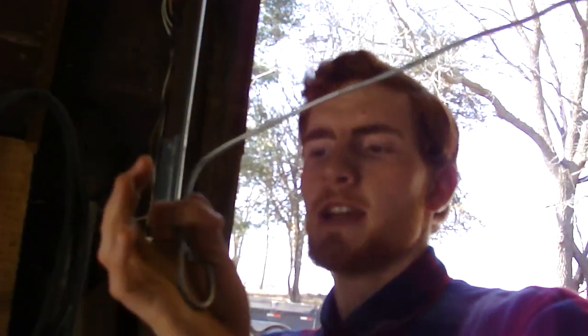This tool right here is what we call our slag dipper, and it's designed so that you can be a little ways back from the edge and dip out slag. And slag is just basically any surface area on the metal has a little tiny bit of dirt on it, and so it makes slag. And there's actually quite a bit of slag. So the more surface area you have of the metal you're melting, the more slag you will get in the metal.